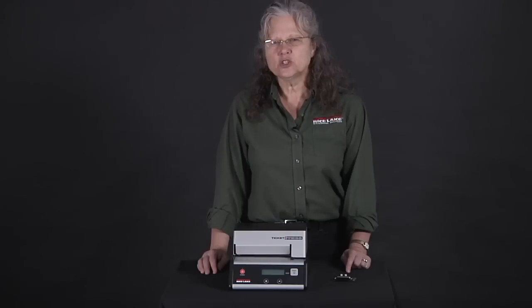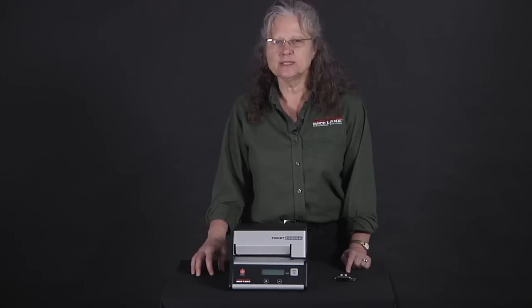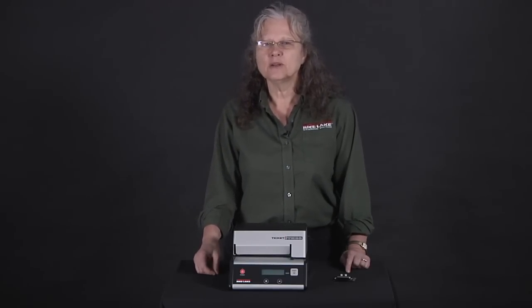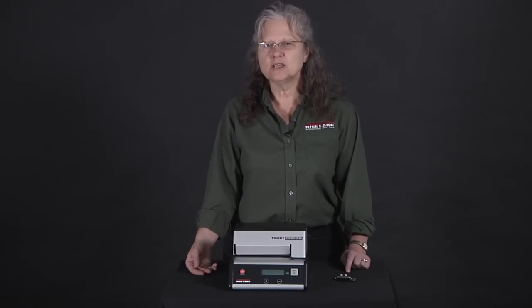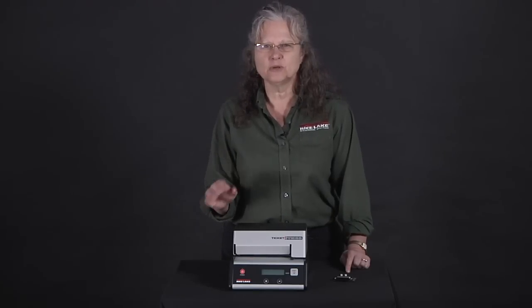And in this weight extraction mode, we have 2 modes itself called demand or continuous. And most of the time you're probably going to use demand. And here the print button is used on the printer and it records the next complete record. In continuous, the printer is going to be printing all the time the information it's received, so it's just streaming out data to the printer nonstop.